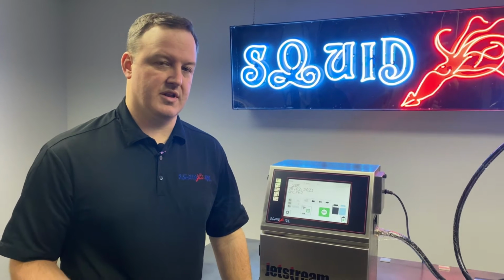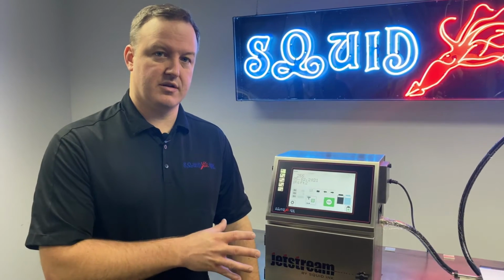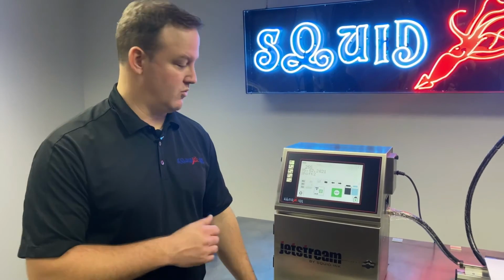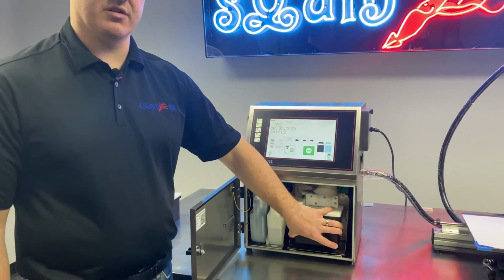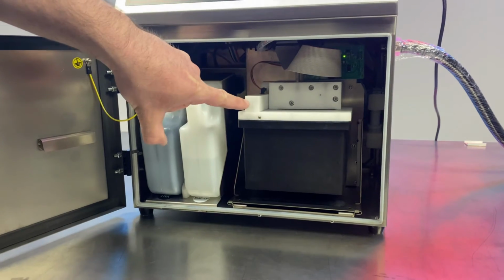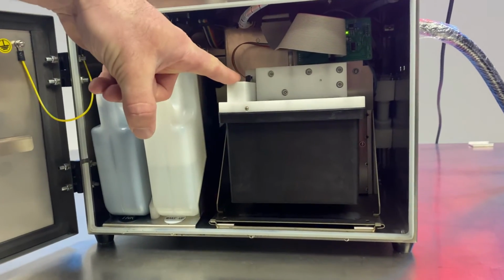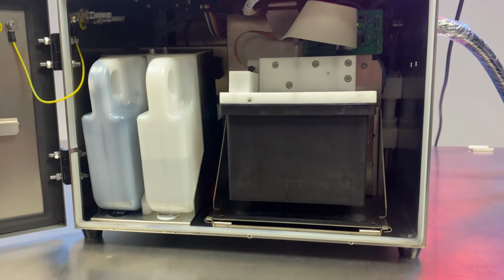If you're not certain that the system is accurately measuring the fluid level, we can take a more in-depth look at this. So what we're gonna do is we're actually gonna slide our entire hydraulic assembly out the back of the machine, and the reason for that is we're gonna actually take this cap off. This covers the tops of those level detection probes. So we're gonna take this off, and we can actually meter out each probe and see what kind of signal we're getting there.